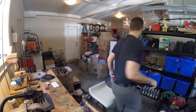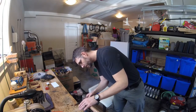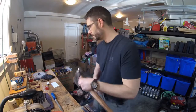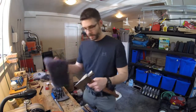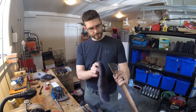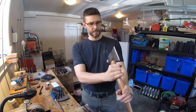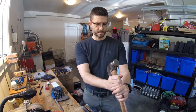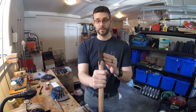I'm gonna grab a file and hit this for a second. So, for the fact that this is a fairly old axe, there's a little bit of deformation in the head piece. I had to do some work on the eye and ended up with some gaps. I'm not happy with that — it's not perfect; it's a little off-round. But you can see how the actual axe head itself is not square either. This axe has seen a lot of use and a little bit of wear.